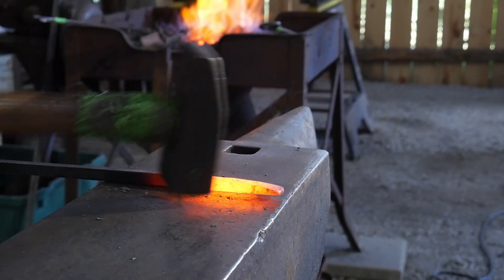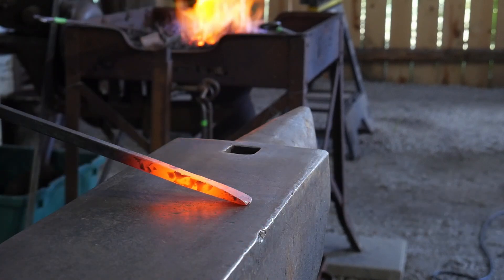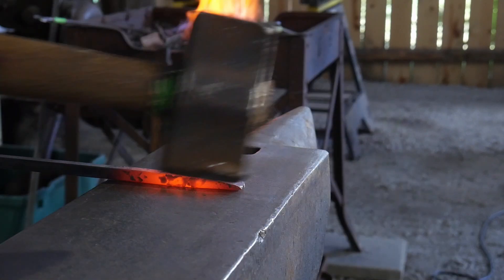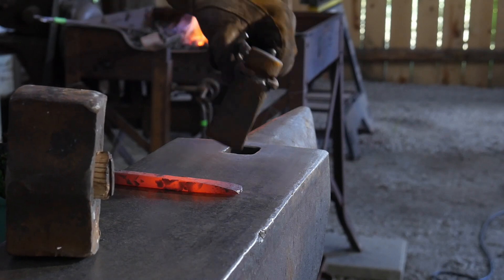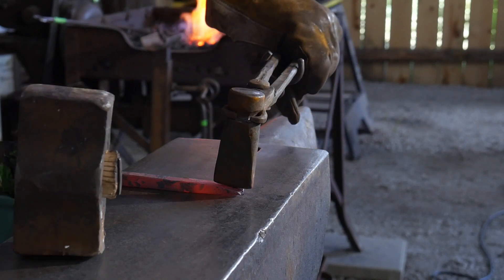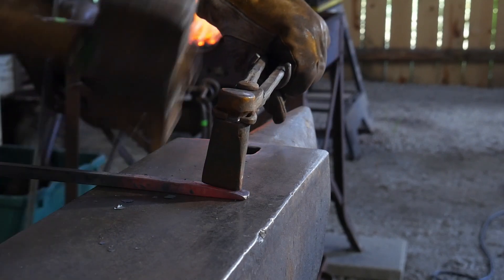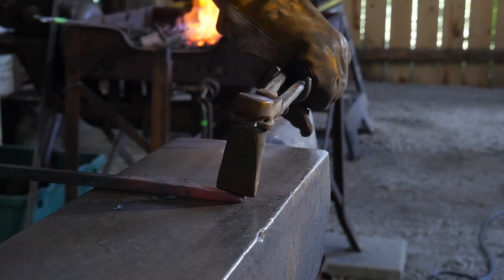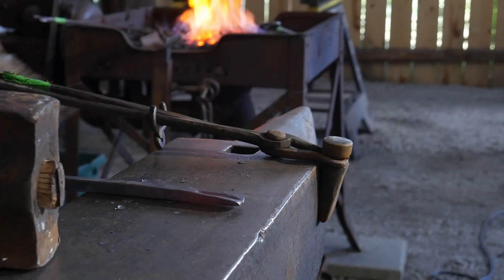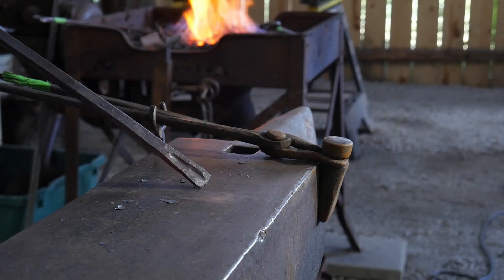The first difference is we're going to leave this fairly chunky on the end because we need enough material to be able to fuller down the center of this bar. We don't really want the fishtail to spread it out super thin because when we use a fuller there will not be enough material to spread via the fullering action. The single fuller vein right down the center is what makes this a single flute scroll. If you had two fullers next to one another with a ridge in between, that would be considered a double flute scroll. Likewise a triple flute, and so on and so forth.